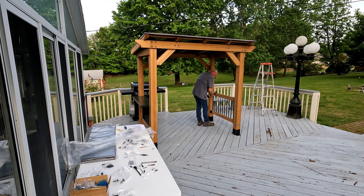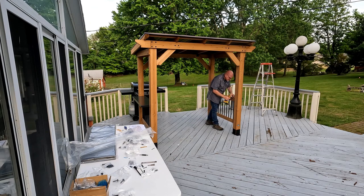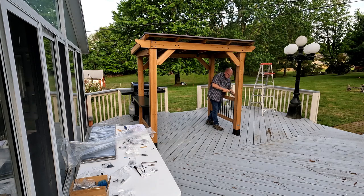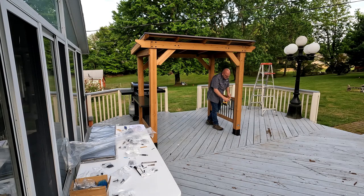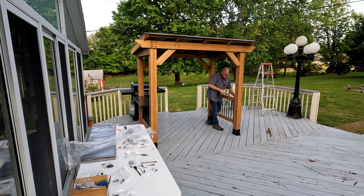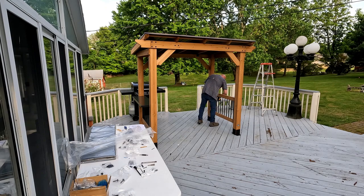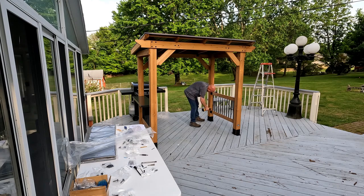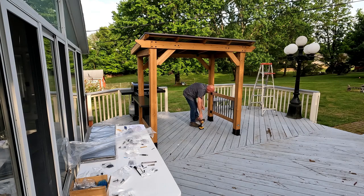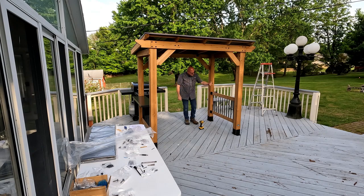Take out the top two bolts on both sides. All the way out. Loosen the bottom two, one side, actually both sides, because I have to create a gap here on both sides. And then loosen the bottom rail on one side. It's fine. Now use a mallet or if you got safety boots on, kick. Now I've got my gaps.